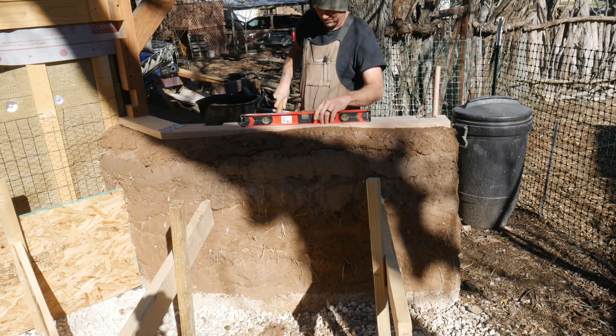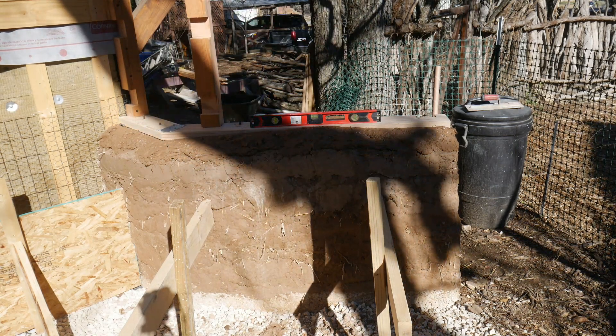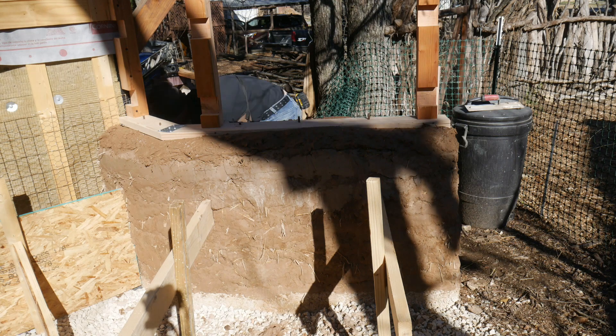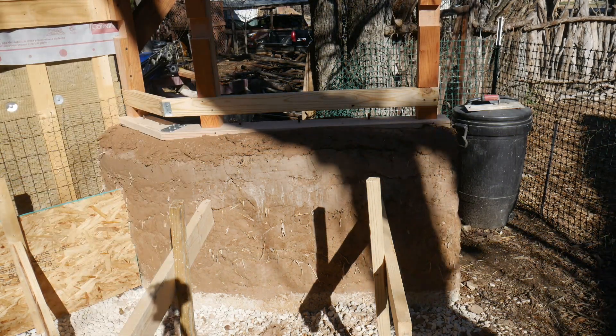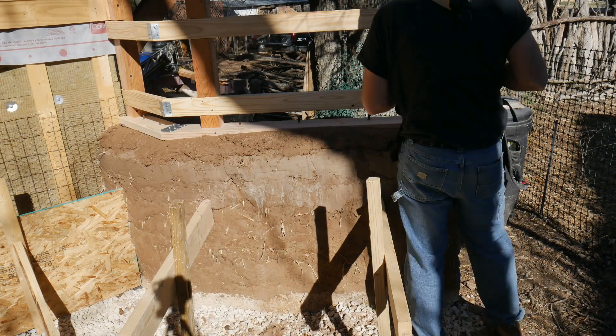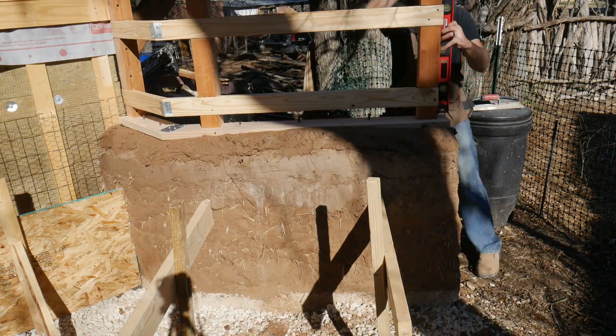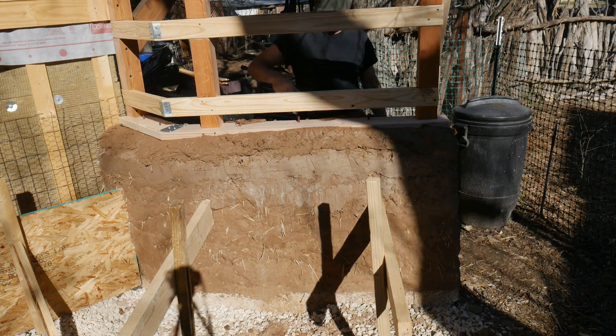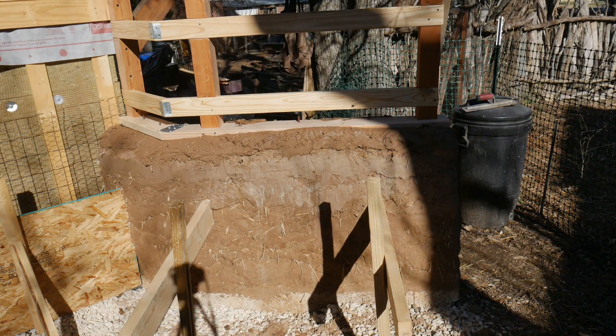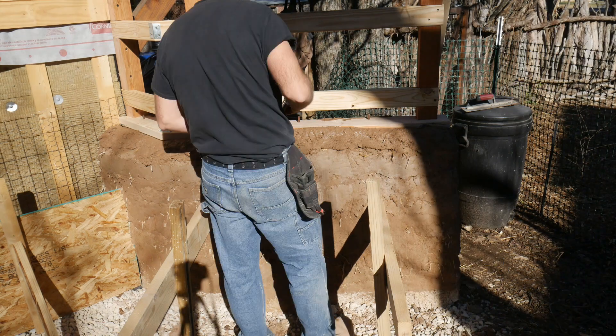I set the bottom horizontal portion of the fence into the wall and drove in a short piece of rebar to tie it to the retaining wall. The 4x4 posts are attached to the horizontal boards with box joints and metal fasteners. After assembling the structural components of the fence, I buried the bottom six inches of the fence to really anchor it to the wall. After backfilling is completed, I'll attach vertical cedar planks.